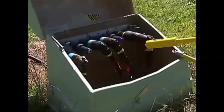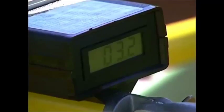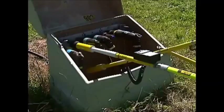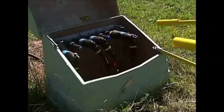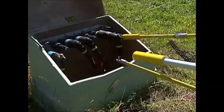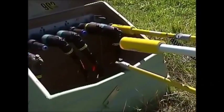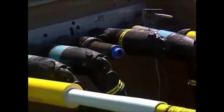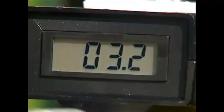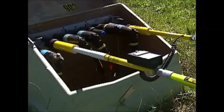If you'll go into that hot bushing, Kirk, and I'll go line to ground — we're going to read the line-to-ground voltage, and that voltage is 3.2. The reading we expect to get will be between 60 and 70 percent of the line-to-ground voltage, and that's what we're seeing here on the meter. I'll put my non-metered end into the bushing for the cable we want to test. I'm seeing 3.2 — that's a bolted fault. It's as short as it gets. We've got a bad underground situation here.